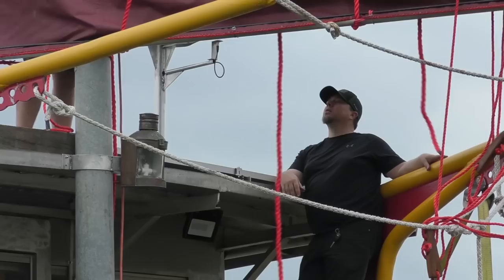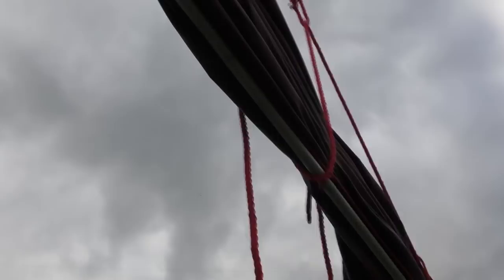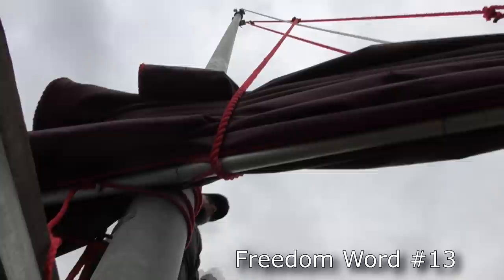This is why Chinese junks reign supreme among boats. If you want to reef easily, that is the reefing. Just let the sail down. Beautiful. Keep everything very orderly. We get all these lengths right, it might be good to bunch it up, hang it from the halyard, take all the ropes ashore, and make hard splices so it can't run. Not through that thimble. Yes.